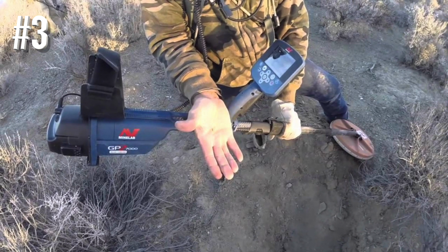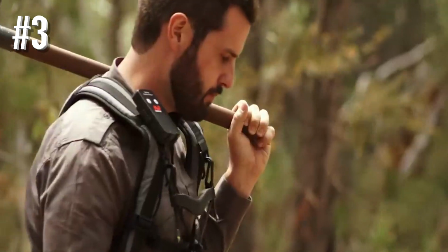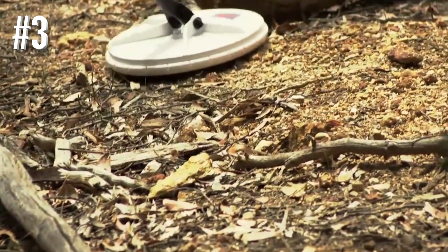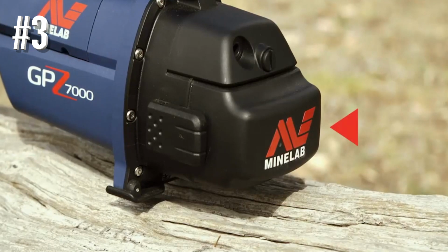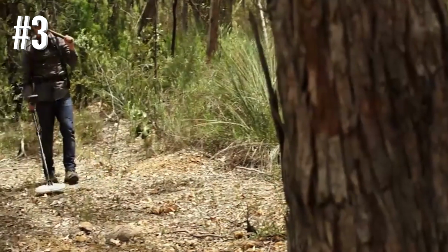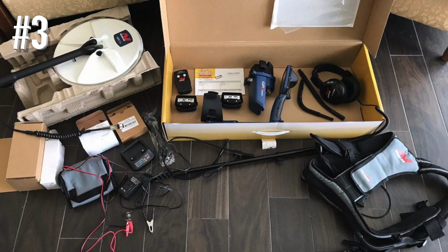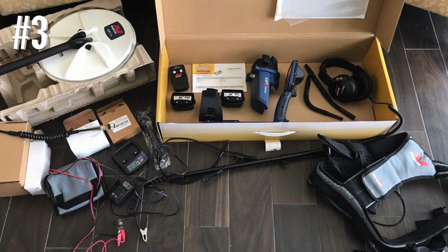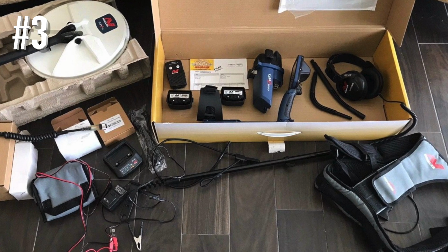With standard metal detectors, there's always a trade-off between sensitivity and depth. Higher sensitivity increases interference, which reduces depth, while greater depth decreases sensitivity to smaller objects. With ZVT technology, this trade-off is minimized, which allows the detector to provide both increased sensitivity and impressive depth. The result is that the 7000 is fantastic at detecting both deep nuggets and smaller flakes.